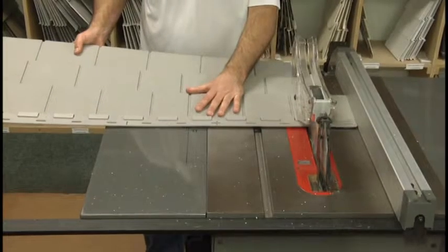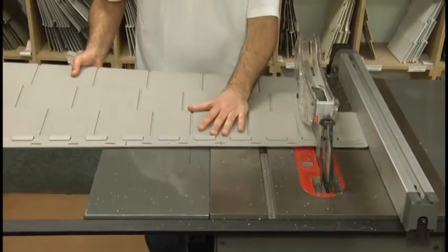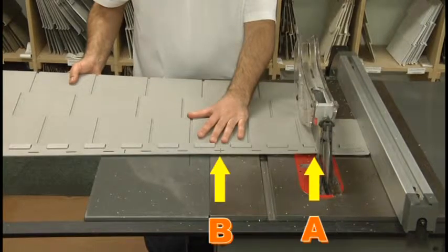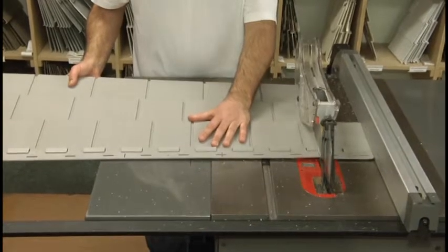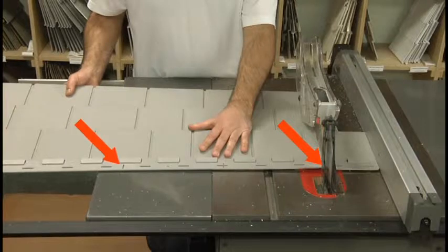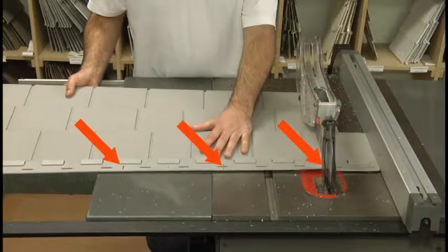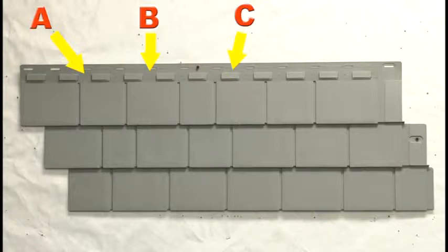Cutting Exterior's Cape Cod Perfection EZ, a 3-tiered panel, includes 3 easy steps. A, B, and C cut line marks are embossed directly on the top flange of the panel. The panel can first be cut on the A cut line, with the second cut on C and the third on B to avoid vertical seam overlap and to break up repeating pattern. Following the specified A-C-B cutting line order on succeeding rows will provide an authentic and random shingle appearance.